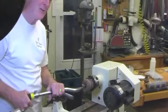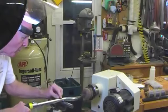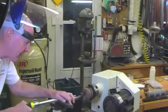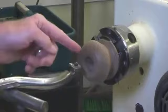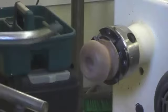So this will get you in around the corners. But the important thing you have to think of is you want the cutter to be fairly well in line with the axis of the shaft here. If this were straight and the bit were on that, you have a tendency for it to torque on you and roll, and that can lead to not much fun, or can even be dangerous. If you're doing an urn, then this will get in around the corner, and you can use it to go up in the inside here. So as far as hollowing is concerned,